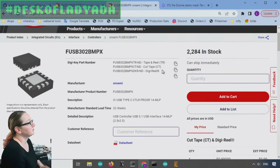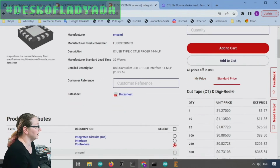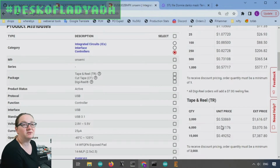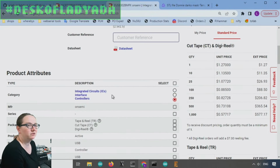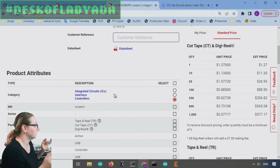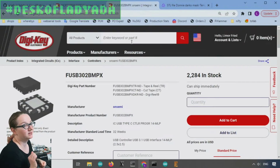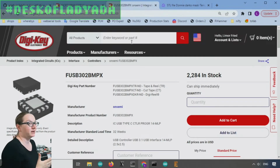So there's a whole bunch in the family, Type-C controllers. They're fairly inexpensive. They're like 50, 60 cents, which is a great deal. So you just plop it on. It's not even very big, connected to the CC lines. And over I2C, there are little drivers that are published everywhere for various platforms. Tell it what you want. But like I said, it doesn't have a built-in regulator as far as I can tell. You need to connect an external 3-volt regulator that can run off of the USB no matter what.